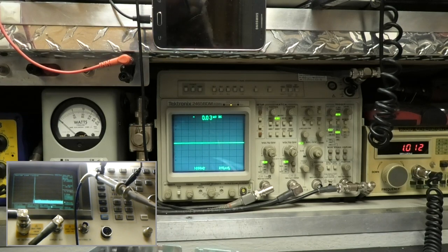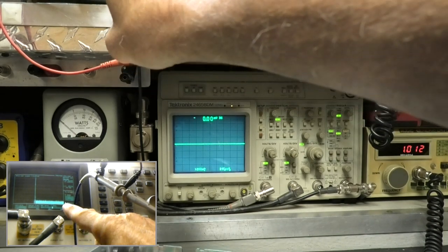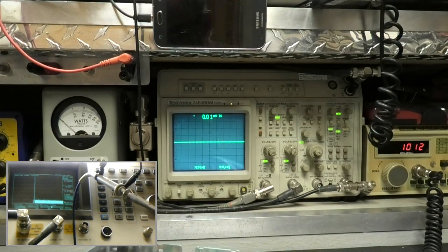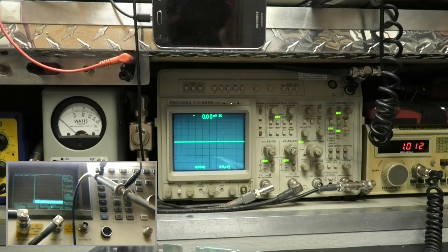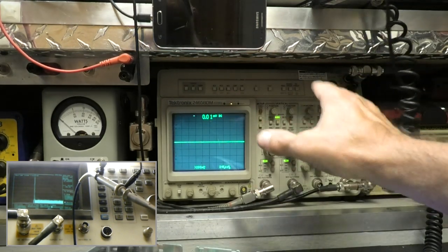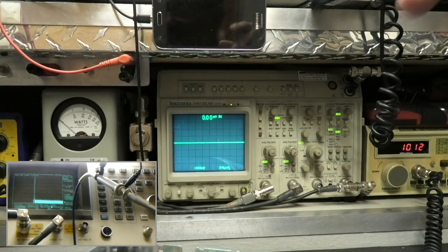Did you learn anything? That thing is badass. The RF generator, the frequency counter. It's got a scope in it too, but it's only 5 megahertz. It's basically for AF, or audio frequency. I use it from time to time. That's what all this is for, generating the tone, the voltage, and checking distortion in radios. Like I said, we've just barely touched the tip of the iceberg here, and we're just trying to get people caught up.